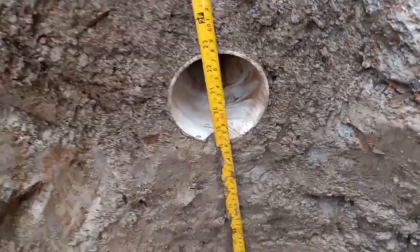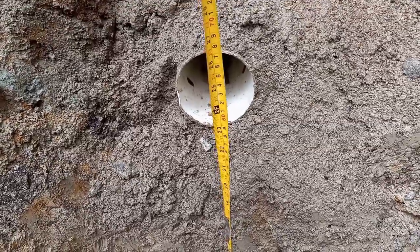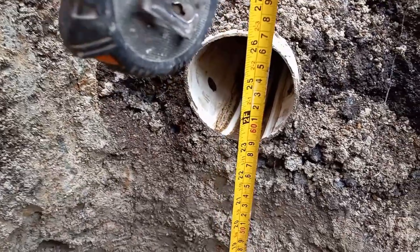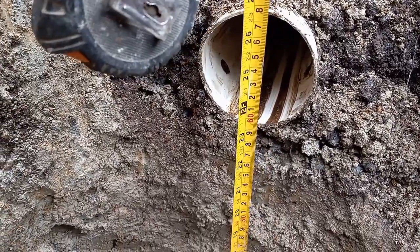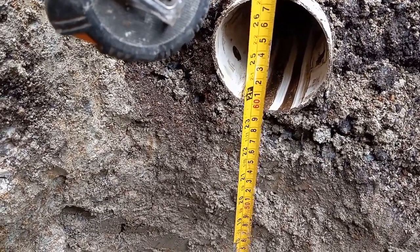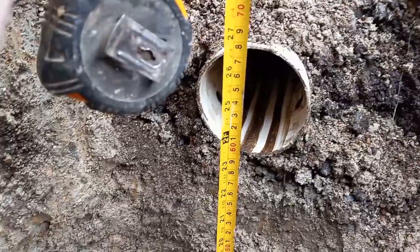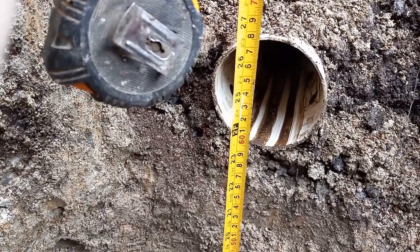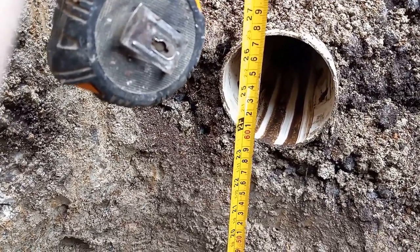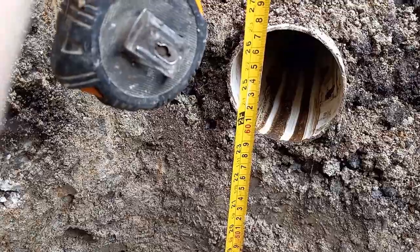This is the outgoing line. This is one drain tile coming in, and this is another drain coming in — I measured them more exactly than I'm showing by hand. The incoming drain tiles have to be higher than the outgoing line — usually two inches higher, but one inch or even a quarter inch is acceptable, as long as they are higher than the storm sewer line going out to the city sewers.